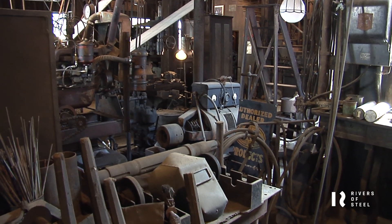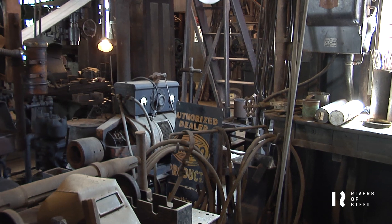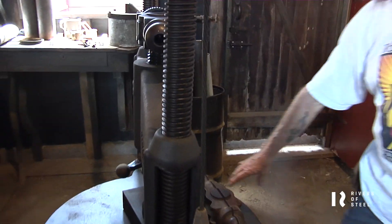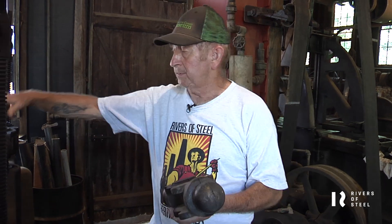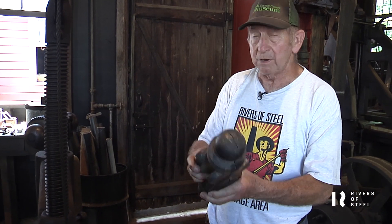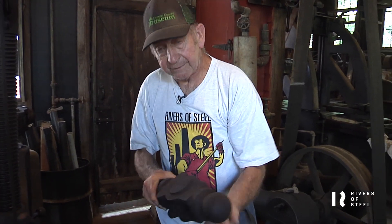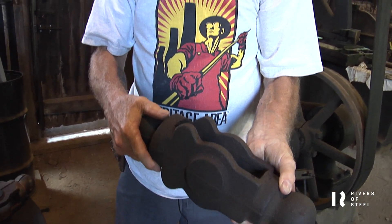There's an arc welding machine from 1921 that was belt-driven also — we think it will run pretty well. This was a press for pressing bearings and things. This is a wooden pattern that was this part of the machine, and they must have broken it, so we have had to make new parts. This is a casting of the same piece, but it has not been machined yet.